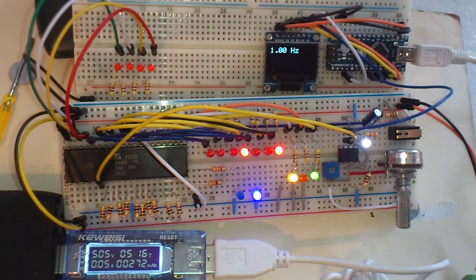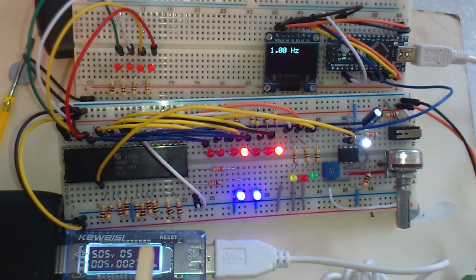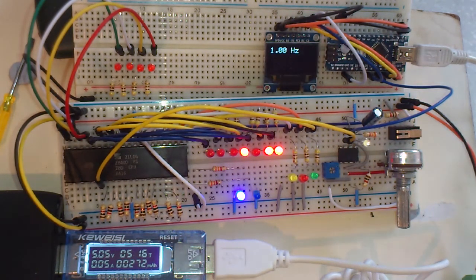They interfere with the operation, so we pull them high. And there's 2 interrupt pins as well, the normal interrupt and the non-maskable interrupt. We don't want interrupts being generated randomly, so we pull those high as well. Now this is explained in the schematic from the test circuit on Z80info.org, so you can read about that there. Right, anything else to say?